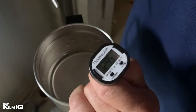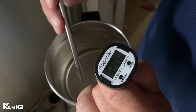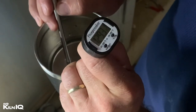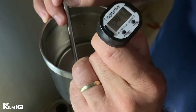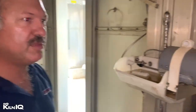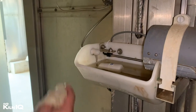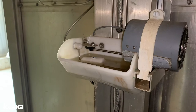I've got the cup of hot water, the wet bulb probe, and my culinary thermometer — it's measuring currently 129.3 Fahrenheit. I'm going to phone the guy in the control room to confirm what the temperature is showing for this probe. We've just done the calibration check on the wet bulb and found that our test probe and our actual probes were less than 0.5 degrees Fahrenheit apart, which is accurate enough.